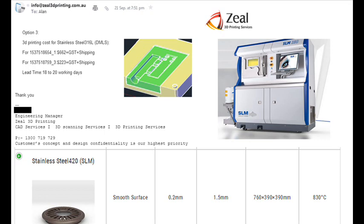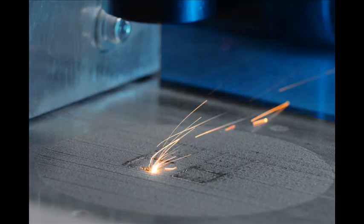The inner green bit has a lot of wasted material as it's a quick CAD job. If I make it much thinner — at least 5 to 10 millimetres all the way around the part to be used as a heat sink and enough for venting — with the rest being ABS, we should be able to have a super affordable, around $200 two-part mould.